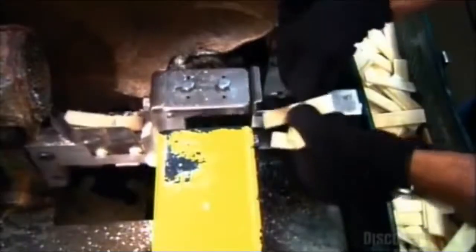A rocking cutting tool carves ridges into a piece of cow shinbone. The shinbone will adorn the pocket knife handle. They submerge a bag of those ridged shinbones in a vat of dye, tinting them a vibrant green.